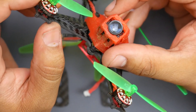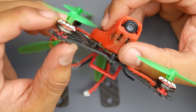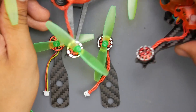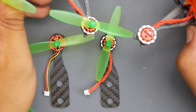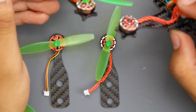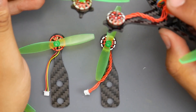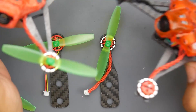I've also tested the Happy Model motors on a 3S HV — totally fine, not hot. They can handle 3S just fine. I also tested the Red Devil motors. These are exactly identical even though they say the KV is different — they're basically the same. They both held 3S just fine without heating up, which is great. So they are 3S compatible, fully compatible, and you just need an ESC to take full advantage of that.